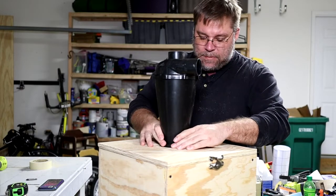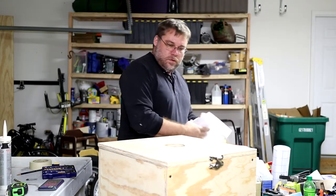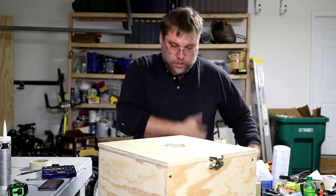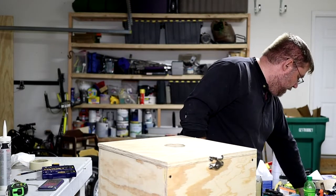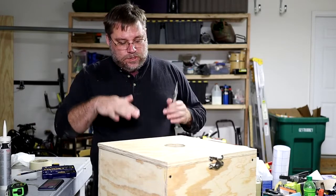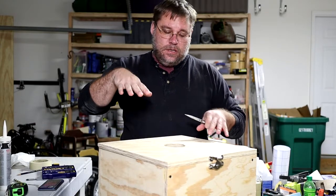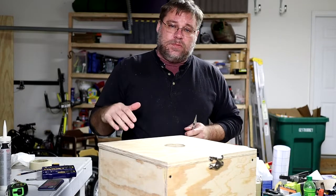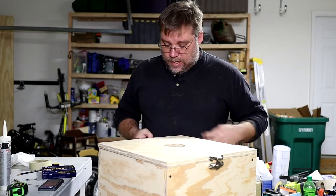I'm going to go ahead and place the cyclone on the top here so that the hose is aiming out where it's more usable in my workspace. I'm going to use some bathroom caulking to seal around this just to give it a good seal and cut down on airflow through there — you want as much vacuum as possible going into the bag. When we go to seal this up, putting the trash bag over the top to collect all the dust, I'll probably come back with some window sealer to give it a nice tight seal.